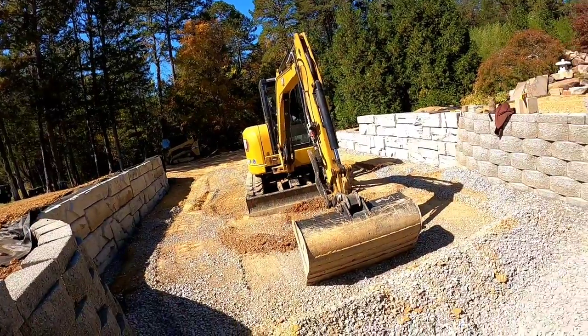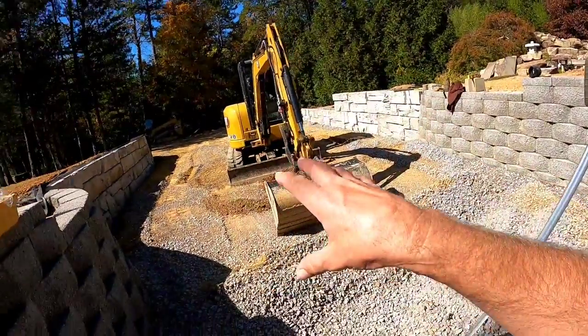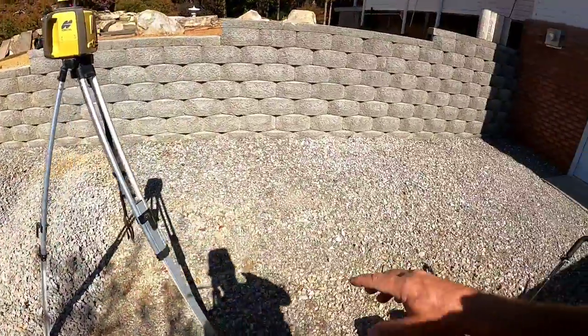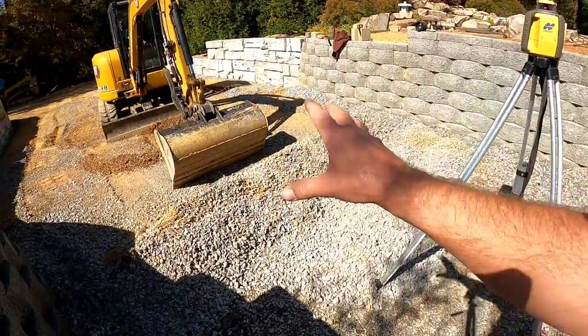All right, I'm ready to get started. And this is probably one of the better videos that I've done that really shows the capabilities of the Trimble Earthworks system that I have on the CAT 304, and also the Topcon laser that I use. It's a dual slope laser. So this job, I'll explain in just a minute as I set up Trimble Earthworks and the Topcon laser, but just to give you an overview, this is going to be my benchmark where my bucket is now, because we have enough grade from the house out to this point right here where the water is leaving anyway.